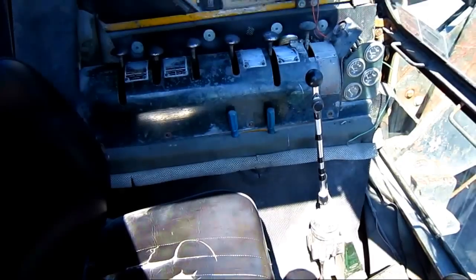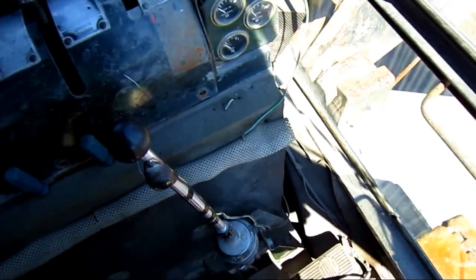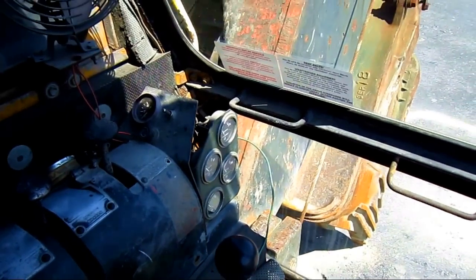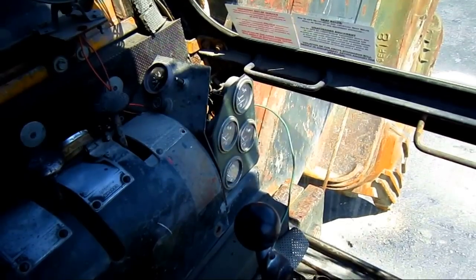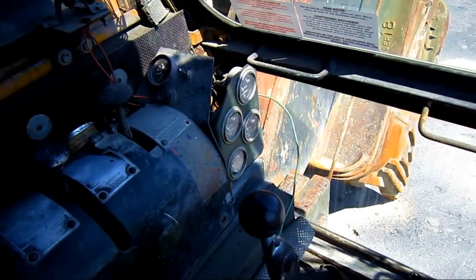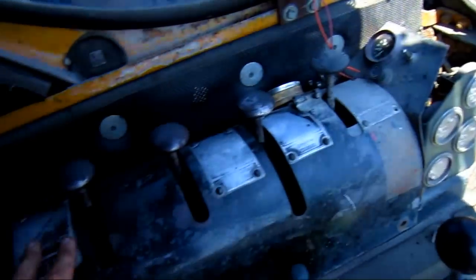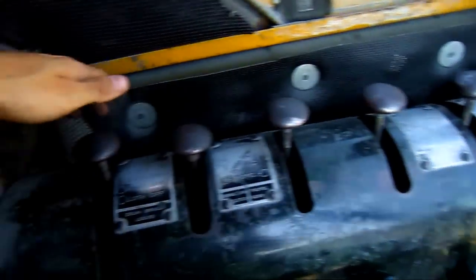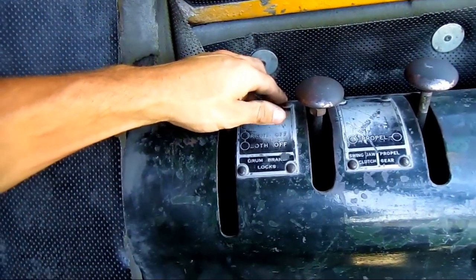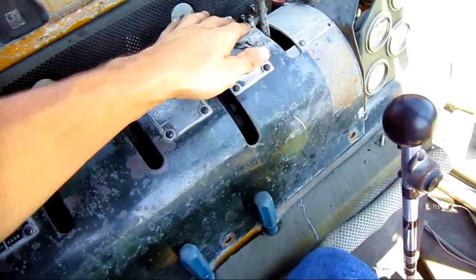Here you can get a good overview of the inside of the cab on an 88B. An 88B is a full air control machine with a single engine, torque converter drive, and twin governor dual controls. This is all air power — all these hand levers over here are for the drum brake locks, swing job, propel clutch gear, clutch brakes, and digging brakes.